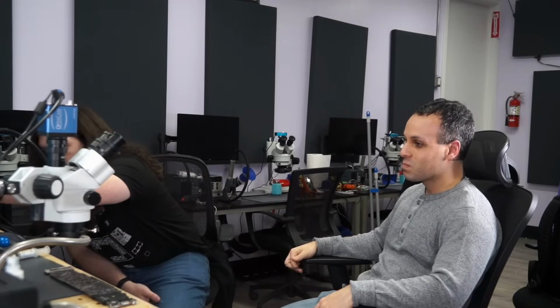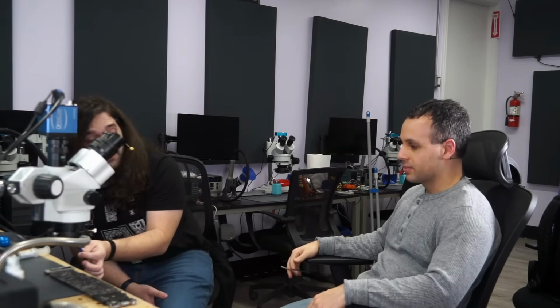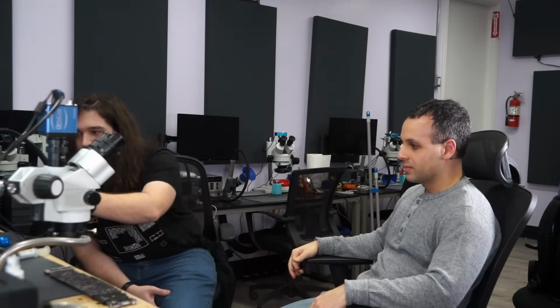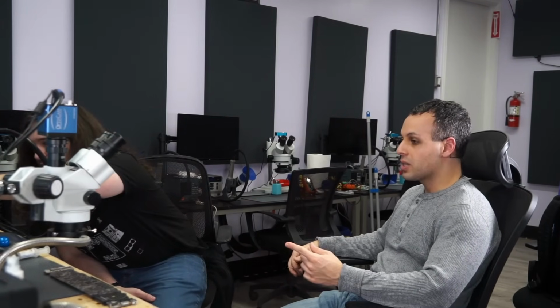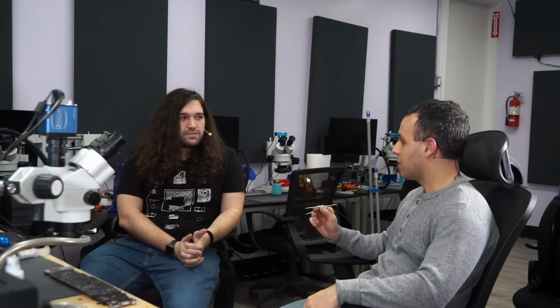Cool. Then the other thing is the tip you have on the soldering iron here is much finer than what I'm working with, but I was working on different stuff. Yeah, if you tried to use that for something like a GPU shunt resistor, it would just get destroyed, because it pulls all the heat out of it. Way too tiny. Yeah, I have a 250-watt iron that I'd probably use for that. That's the one that I use for bike stuff. I see. Yeah, because I mostly work with the 5 milliohm shunt resistors.